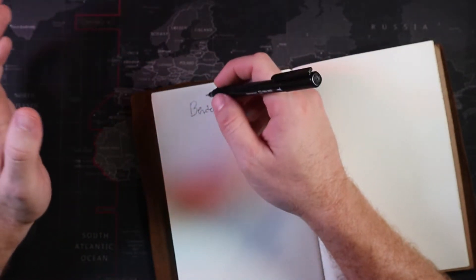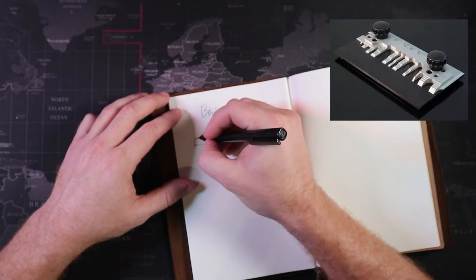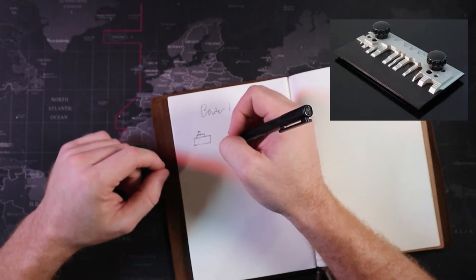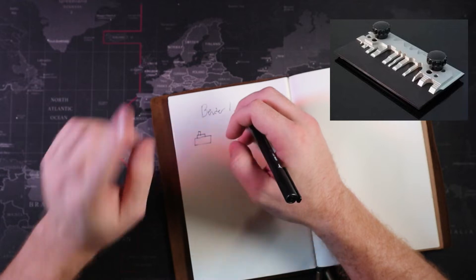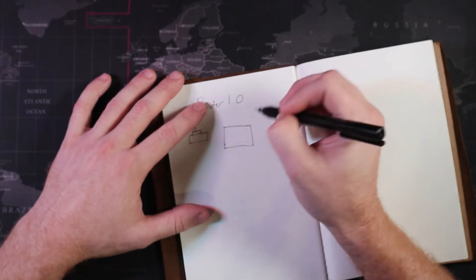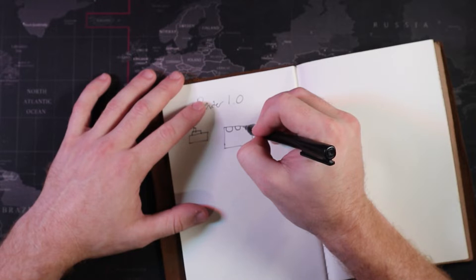If we look at the photo etching community and those photo etching brakes, we can see that they're basically composed of three different parts: they have the base, they have a little block on top which I refer to as the cheese wedge, and then we also have a little knob that goes on the top. How these things are designed are very specific to what you're looking for. We're going to do this with 3D metal models in mind. Our cheese wedge — let's go ahead and start with a little rectangle here. It needs to have at least a few cutouts for cylinders.